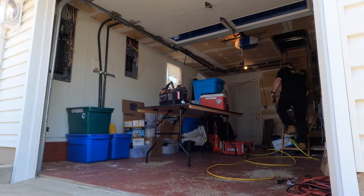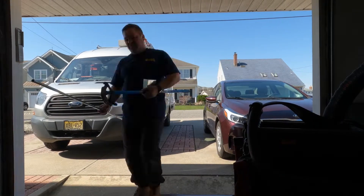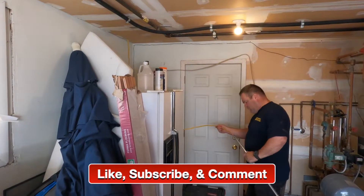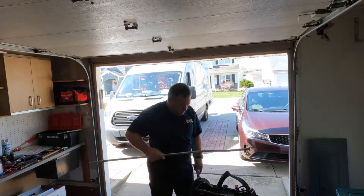What I'll do is attach a piece of half-inch EMT to the wall and attach my GFCI receptacle. Working with EMT is pretty simple — I wouldn't consider myself an expert EMT bender, but for this kind of work I'm pretty good. I'm putting in two offsets: one for the box and another offset to go up through the ceiling to receive the wire.